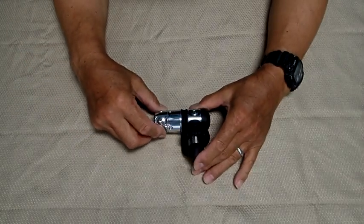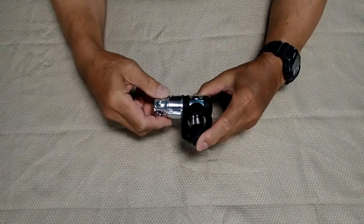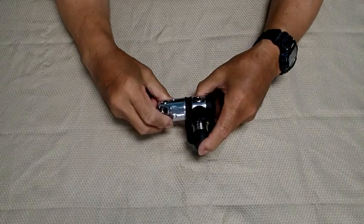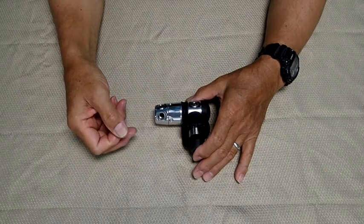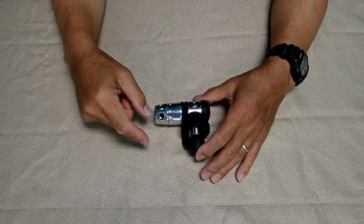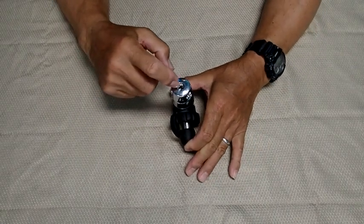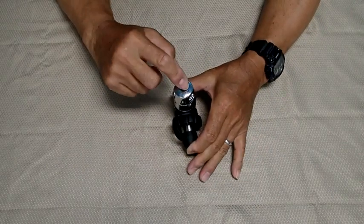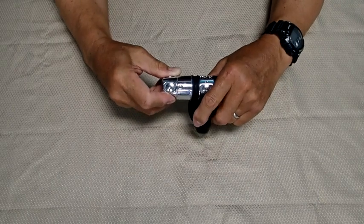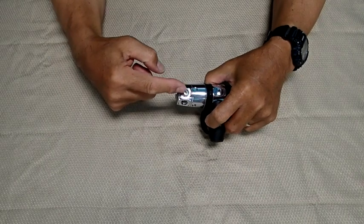The cylindrical piston regulator is representative of many types — the Atomic M1, the ScubaPro Mark 25, the Halcyon, and others. Some diaphragm regulators share a similar layout. These regulators can come with or without a turret, and the turret makes hose routing easier. Many of this type have an extra port: this one has four ports around the turret and one on the bottom. One key issue is the angle at which the low-pressure ports sit, which enables two hoses to exit at a 90-degree angle.